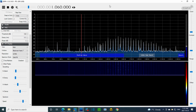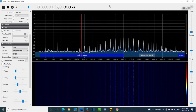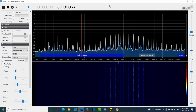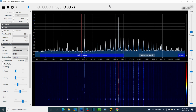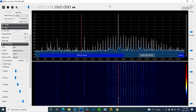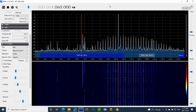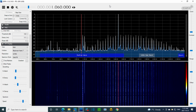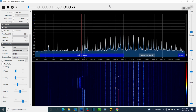Now, I want to show the local oscillator on my SDR that you're looking at now. So we'll jump down to the AM band. Now I didn't show you this on camera, but I have a little loop I'm waving around. Wow, you see that thing show up there? That's me waving this loop around. It just has to be in the realm of those oscillator coils. Okay, it's hanging. I'll tune the radio just to prove the local oscillator. There you see it moving around. Okay, now we're going to go to the next band.